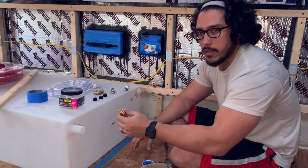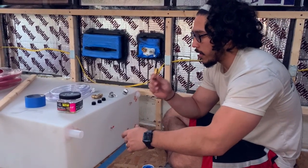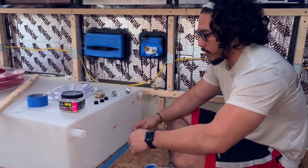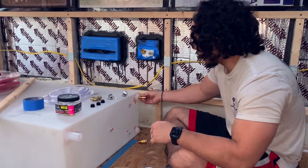I'm out of breath trying to explain that because it's very confusing and very overwhelming. I know that might not make a whole lot of sense because there are no actual pipes there, but it helps us realize where everything goes, how many fittings we need, and what the general idea of our system is gonna be and if it's gonna work or not. What we can actually do before the installation is attach the fittings that are gonna go to the water tank. For that, like I showed you, we're gonna use a barbed fitting — it's gonna go from here to the hose.